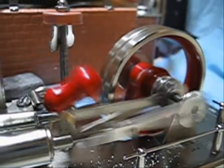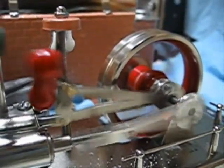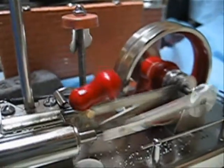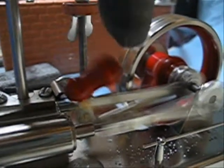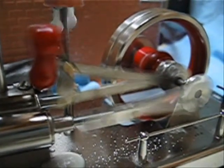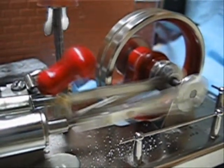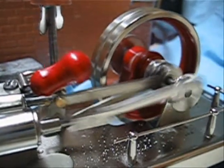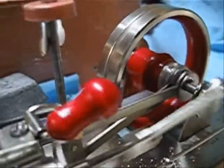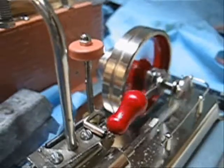We'll get some slow running after I turn down the heater a bit. Open it up wide again. The timing sounds pretty good to me. What I'll do later is hook up my tachometer to it, and if the engine's pulling roughly the same revolutions in either direction, then the timing must be right. But for now, this is good enough for me.